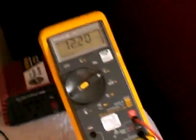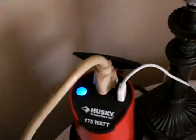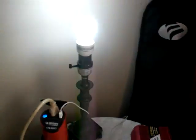I have my meter hooked up to it to tell me how many volts are there, and then it goes into this little inverter I have that was, I think, 30 dollars. Now I got two CFL light bulbs in there, and I'll turn them on — see, now they're on. That battery right there is a 5 amp hour battery, and these are 140 milliamp light bulbs, so it should last around 17 hours running these light bulbs.